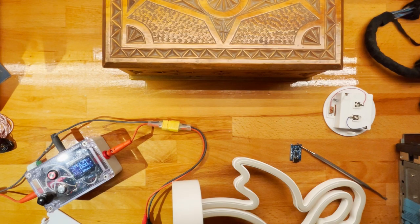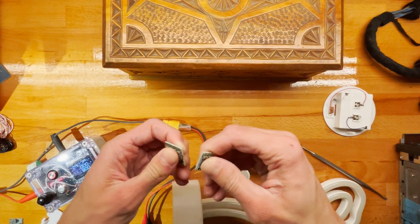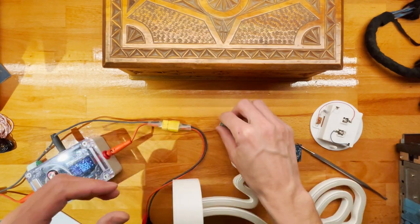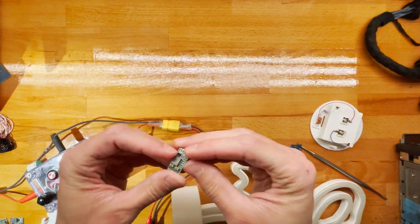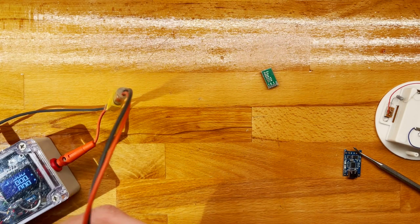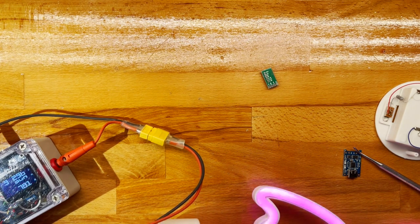Or what we could also do is get one of these switching buck converters. These are very, very energy efficient. And I think we'll swap the one resistor with one of these. Just have to fine tune it. So I'll just link some wires up right now to set the value of this. And then I'll get back to speaking. So let's see how it handles 3.3 volts, because that is a set value on this. It kind of has this brightness, let's see. Half an amp, is it? No,